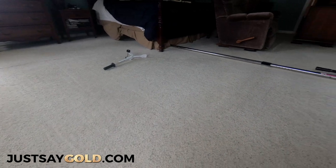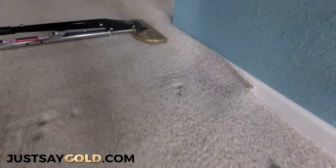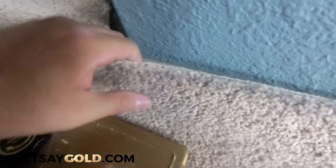Now I have half the room stretched and you can see I have my stretcher set up under the bed. After stretching I was able to get a few inches off this carpet. You have to be very careful to stretch straight when you have cutouts and angled walls, or else it will pull away left or right and you will have a gap to deal with.